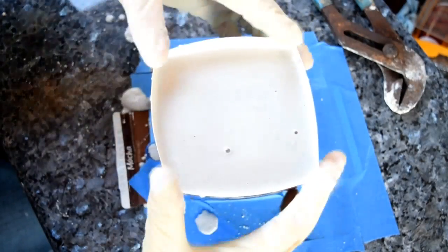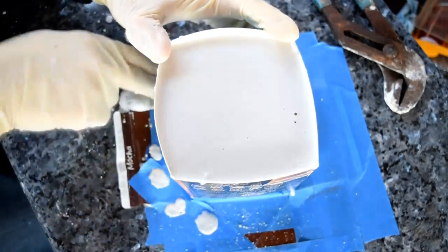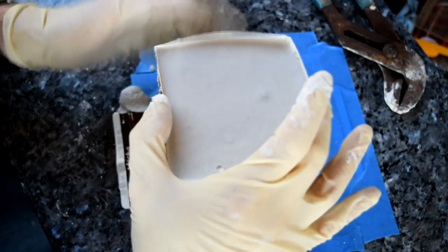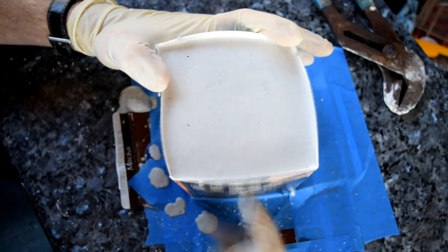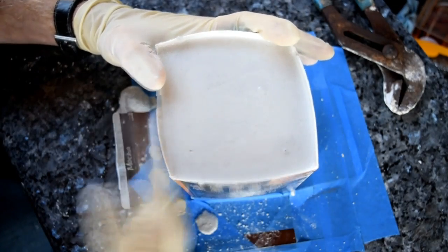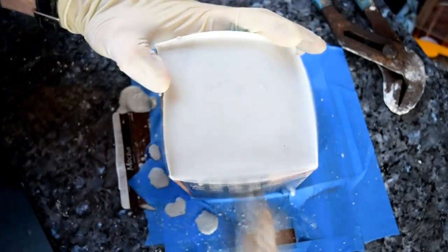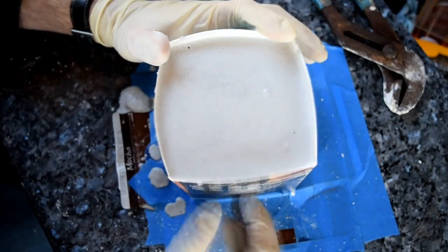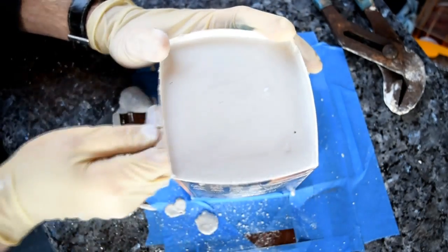Two things to keep in mind here: I made the plaster of Paris and sand mix really wet and soupy so it would get into all the crevices. And the other thing is to jiggle it around to get all those bubbles out — you can see the bubbles rising to the surface as I do this, and that's really important so you don't get any voids in the mold.